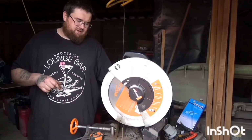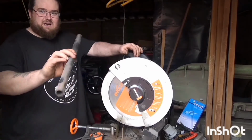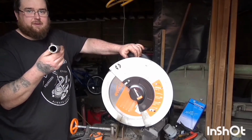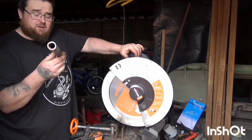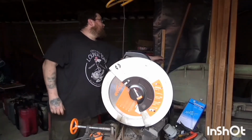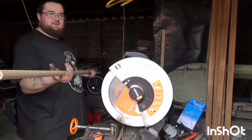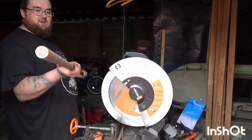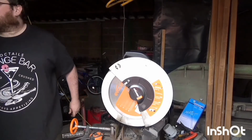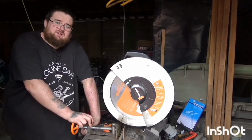So I was thinking, if I drill holes through the doors into the frames and then weld a bit of this 20mm internal diameter pipe into it as sort of a guide bush, and then somewhere over here I've got a length of this 25mm solid round to make the actual bolts out of. Say 3 inches bush, because that leaves me an inch inside to sort of play with.